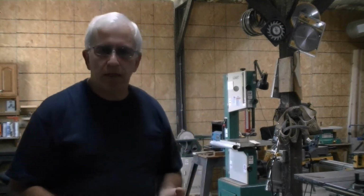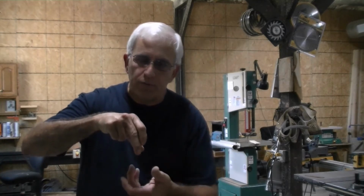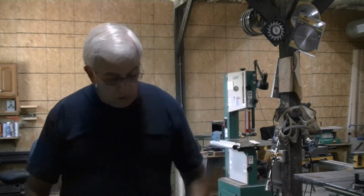Unlike the mandolin bridge, and if you saw the Eastman mandolin that I just recently set up, I turned the base of the bridge around. I kept the saddle pointing the same way, turned the foot of the bridge around, and then recut the feet. On this, you can't really turn them around. They're cut to match the fingerboard, and if you turn them around, you'd have to recut that, and then it would be too low. So the only option is either replace it or repair it. So I thought, what the heck, we might as well try the repair.